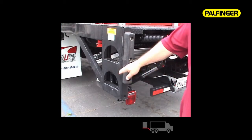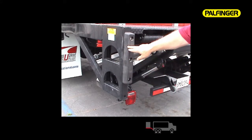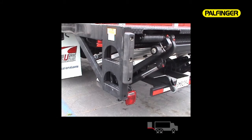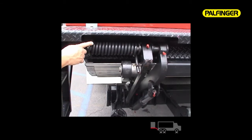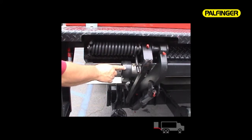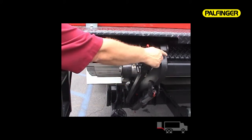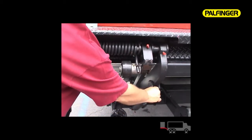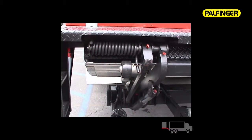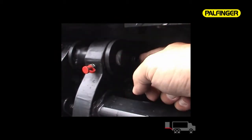Another option is heavy-duty dock bumpers with slip-resistant steps. Add heavy-duty rubber pads for increased protection when dock loading. The ILT platform folds with the assistance of three torsion springs — two on the main section and one on the aluminum tip. High-impact composite rollers prevent wear and damage to major liftgate components. To increase the life of your ILT, all pivot points are greasable with fittings protected from the elements with plastic covers.